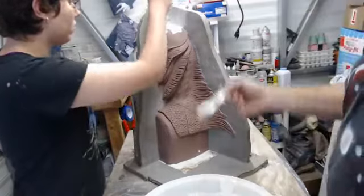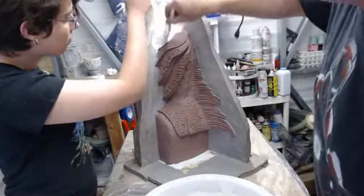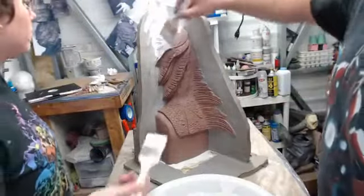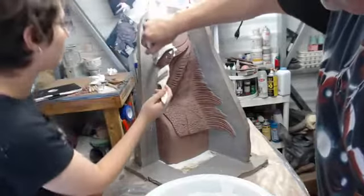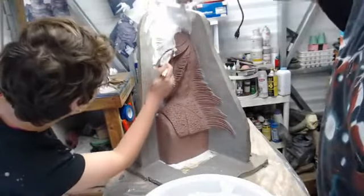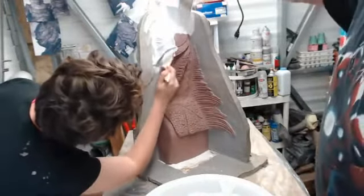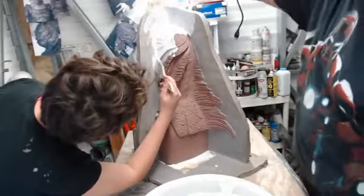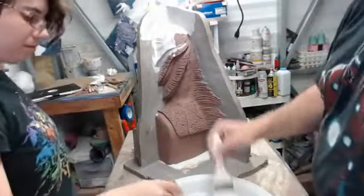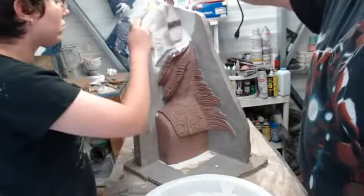And this is only the print coat. So important is we got to make sure that we're jabbing in on all those detail areas because that is where we got to get perfect reproduction. And if you work from the top down, you're not going to be fighting gravity. You know, it's going to be working as much as it can to your advantage. But you want that nice, creamy coat. You see that coat that we've got there?